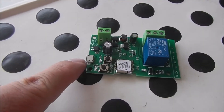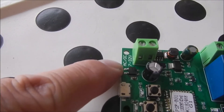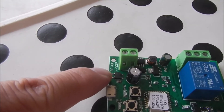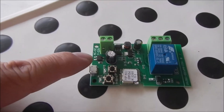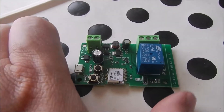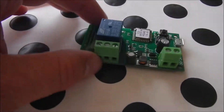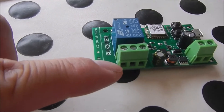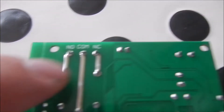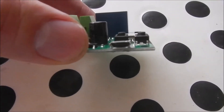This Wi-Fi remote unit I purchased from eBay. As you can see, it's ready to go. It is powered by a USB power input; you can also use AC or DC between 7 to 32 volts. A lot of remote gate systems use 24 volts, so you can check your remote gate power supply. Because this is a small electronic unit, it takes a very small amount of power from the supply. This is the AC power terminal, and here is the relay connector — clearly labeled. This connector in the middle has common, normal open, and normal close. On the other end is the AC power in, and the other is the USB power input.